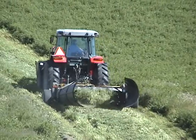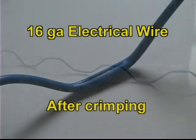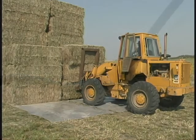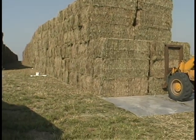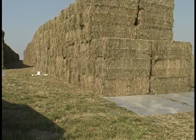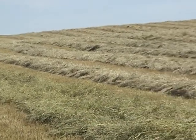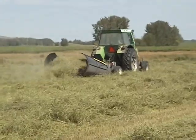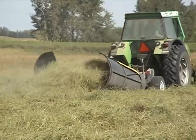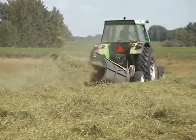The 300 model dries hay even quicker than the 200. Higher roll pressures and a larger crimping surface will save you days when you're trying to cure hay. It speeds up drying and lets you get it baled before the showers hit. There's not much chance of rain damage if it's already in the stack. In side-by-side comparison tests in both Alfalfa and Timothy, ReCon 300 swaths were baled at less than 12% moisture, while the control windrows were still at 30%. It took 2 more days for the un-ReCon material to catch up.